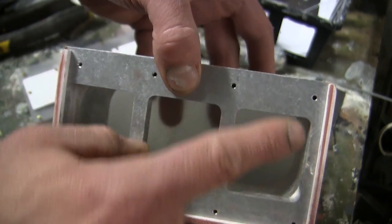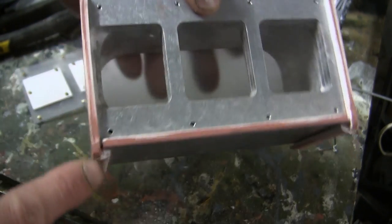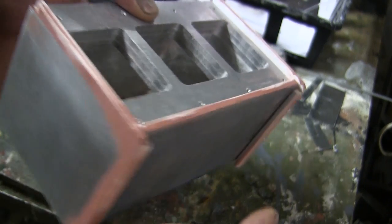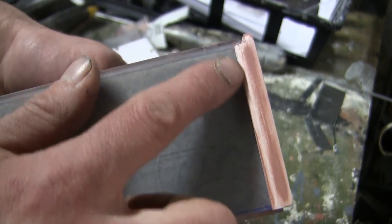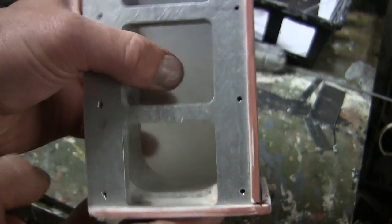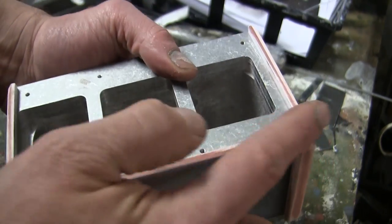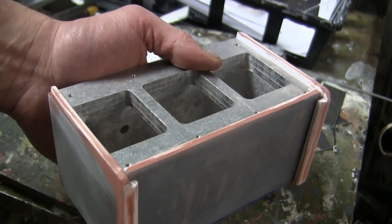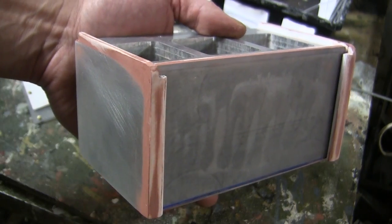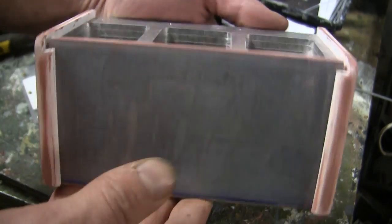If we notice, the two spacers actually curve inward towards the ends and are curved towards the rear portion of the bin. There is also an overhang that encompasses both sides of the bin. This was all fabricated out of styrene strip, which was then glued, shaped, and mounted and puttied into place. The bodywork is all done, making for a nice seamless appearance.